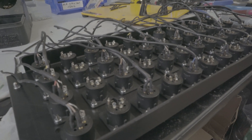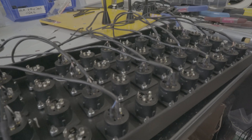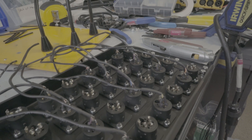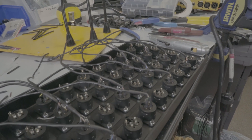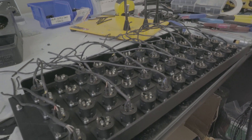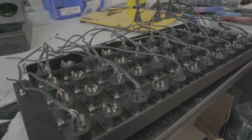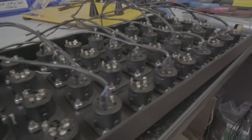We've got all of the output tails soldered — all 24 output tails. You might be asking yourself, man, that was really tedious — is this why they do this with an integrated PCB? The answer is yes, that's why they do it. Now that these are soldered, I'm going to get the output snakes in each group of eight done, and we'll play around with the lacing bars and see how these cables are going to land.